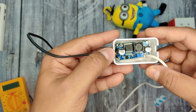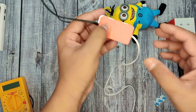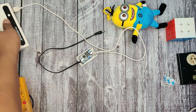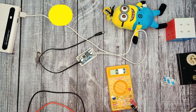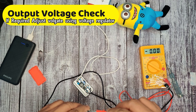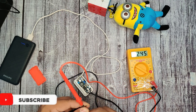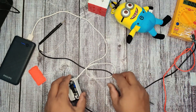The soldering and circuit are well placed inside the enclosure. Before using this circuit, it's better to check the voltage. I'm using my basic multimeter — one side we plug the USB into the power bank and on the other side we check the DC voltage. The DC jack outer contact is negative and inner is positive. You can see the output is coming around 12 volts, and we can set the voltage using this voltage regulator. After setting the desired voltage, let's plug in the outer cover.